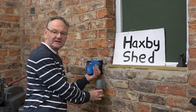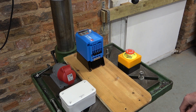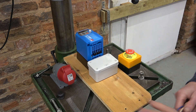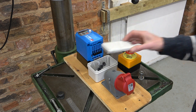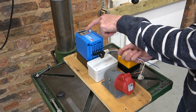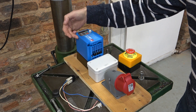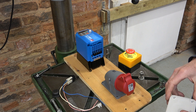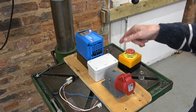I need to figure out how to mount this properly on the wall — that brick wall is all over the place, so I need to mount the electrical equipment on a board. This terminal box here is just an empty box because I need somewhere to mount the reverser switch; this unit doesn't have a front panel switch for reverse and forward. This inverter sticks out a long way because it's got a big heat sink on the back, which is good because there's no fan required, but it does make it rather tall. The electrical connections are here — I'd really prefer to have those covered up.